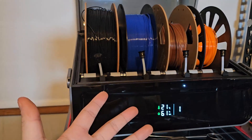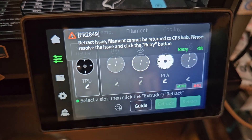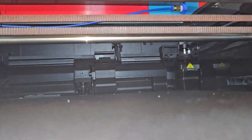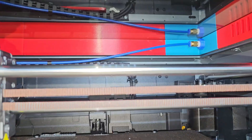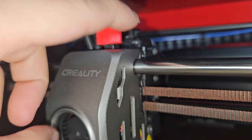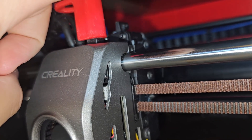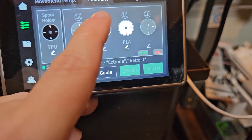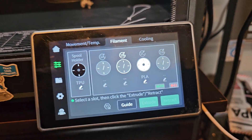I don't know why it always does this. Usually when you press that, it extrudes down there and then turns red, and then it gives you this error saying that there's something wrong with the CFS hub. If we go back and see the buffering, you can see that I can push this without any problems. From my experience, what is happening is that there's still filament in here. Every single time I try to extrude, retract, or do the filament calibration, it will always retract.